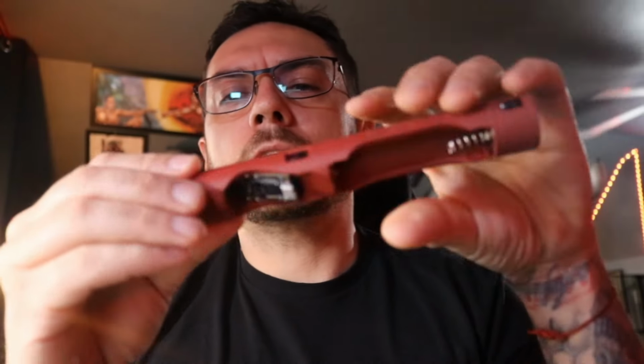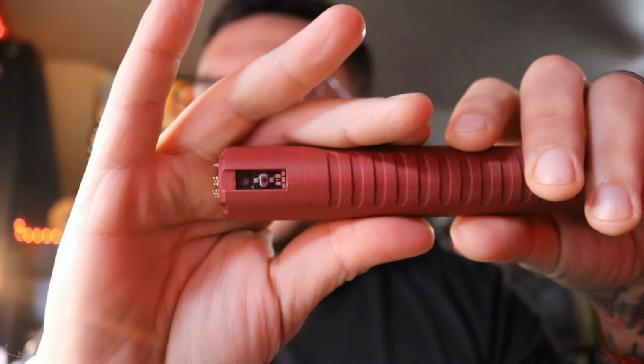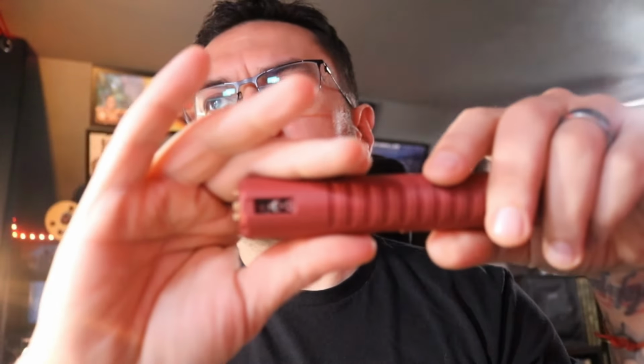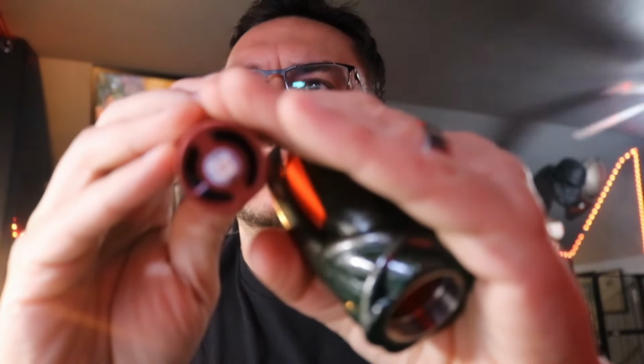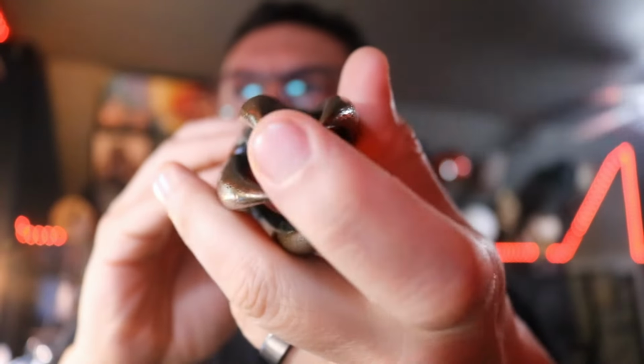So I did use a Shadow Foil Props PCB here for the switch, which has LEDs on both sides of the switch, but the problem was because that plunger is resting right on top of that tactile switch, it wasn't giving the actual switch on the saber any shine through at all. But what I was able to do is light up the pommel very well, which is something that you and I spoke about. So this Neopixel accent, which you'll see here in a second lit up, when it's in here, it lights up this piece very well.